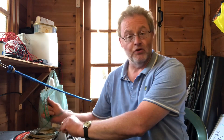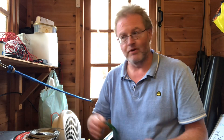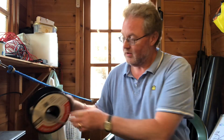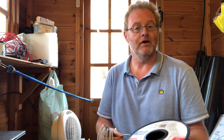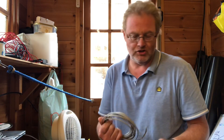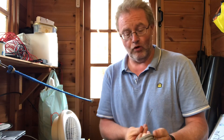So what do we need to make one of these antennas? Obviously you need wire. I'm going down the really cheap route here. I've acquired some light duty speaker cable, about 25 gauge, really thin stuff. The beauty of speaker cable is you've got two wires, so you can easily cut it — these will form the radials, giving you two equal wires to start with. We'll show you the formula for measuring the length of wire you'll need.